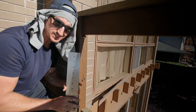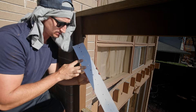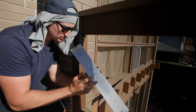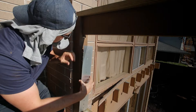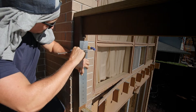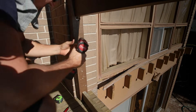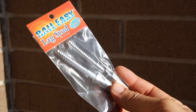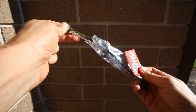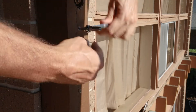Once the cables arrived it was a pretty simple, straightforward process. One of the easiest things about this system is a little drilling template that provides adequate spacing between cables. I start the first hole three inches down, clamp the template in place, then slightly drill into the holes to mark locations for the lag anchors. I remove the template and drill into the post to a depth adequate for the length of the lag fittings. Then I find the lag studs and the corresponding wrench from the installation tools, insert the lags into the pre-drilled holes, and tighten them into position.